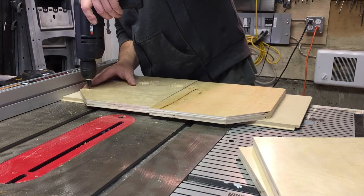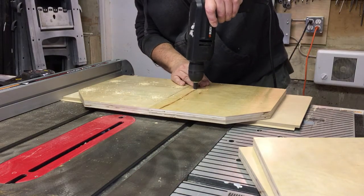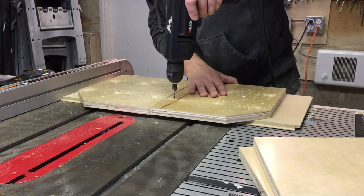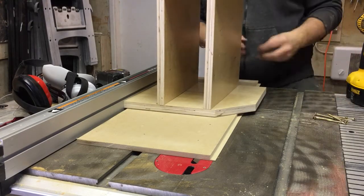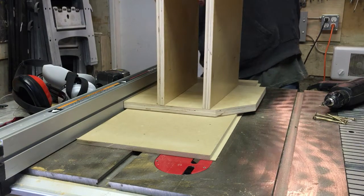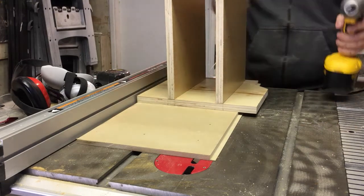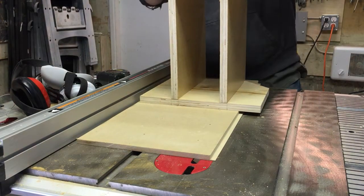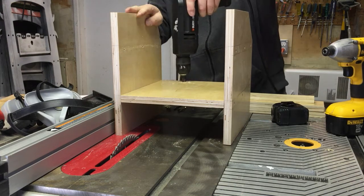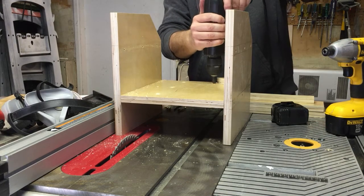Now we're going to drill the holes for the shelves, and you can see I'm drilling them just on those lines I created earlier — do it on both sides. Now I'm putting those screws into the shelves: I put glue on and screw them in, and they'll be very strong. I am only putting three drills into this unit, as well as some screws and some Kreg jig accessories, but mainly it's for just holding the three drills and getting them off of my workspace.